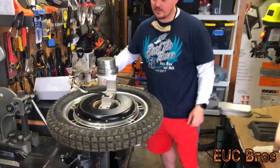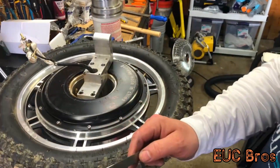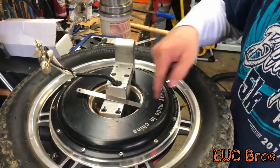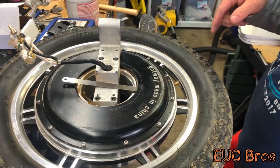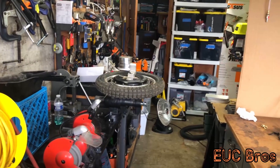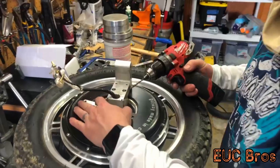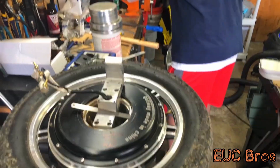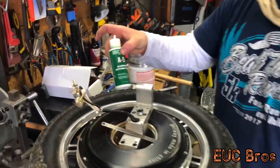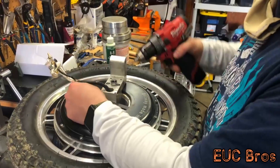Next, we're going to take this piece of shim — I'm using a 40 thousandths piece of shim stock — and lay it underneath where your drill is going to break out and hit that hardened steel shim stock. It won't cut through the shim stock. We're going to use a one-eighth inch drill bit; you could go as big as three-sixteenths, probably no problem. And we're going to use a little bit of aluminum cutting oil — A9 cutting fluid for aluminum.